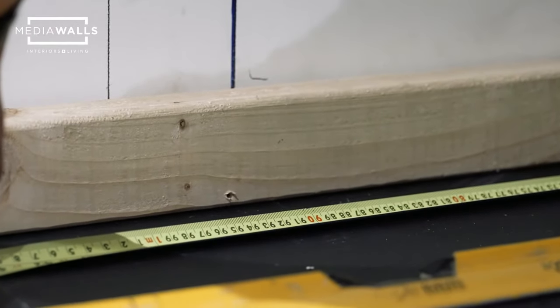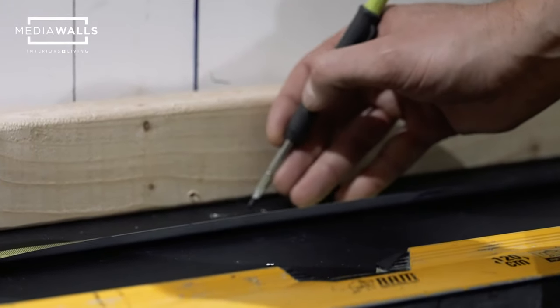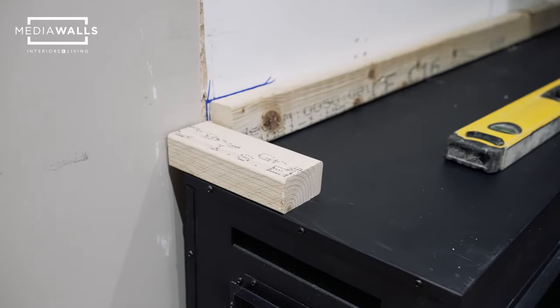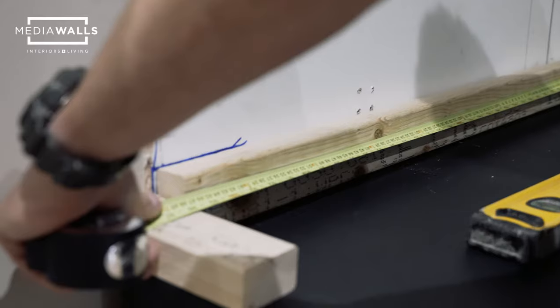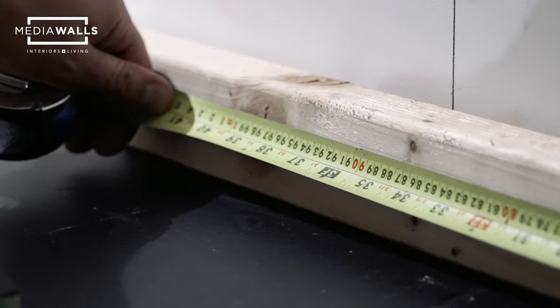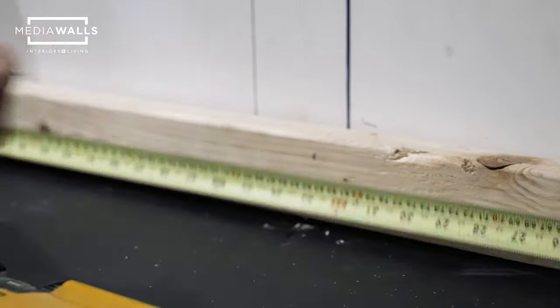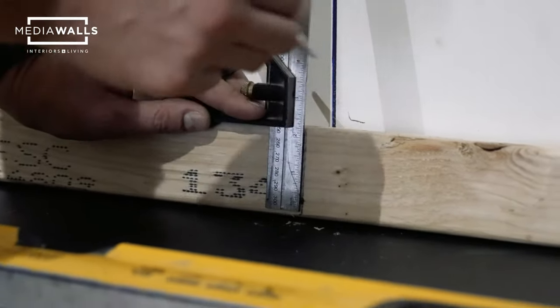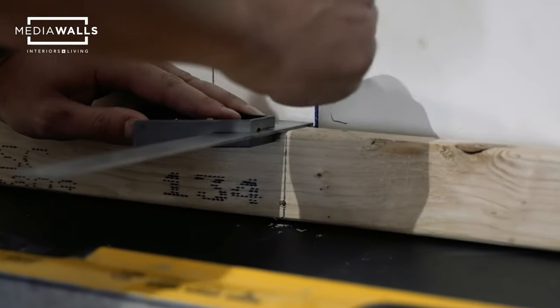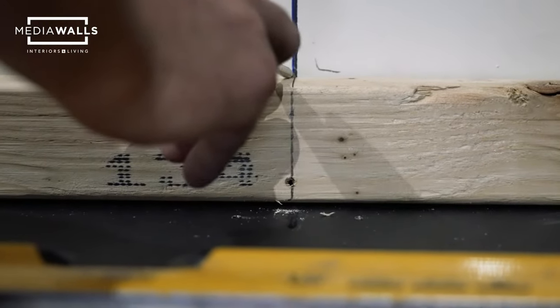Because this fire is the 1800 model, the halfway point is 900mm, so I'm just going to draw a mark at 900 along the top of the fire in pencil. We've laid two offcuts of timber at either end to give us the distance for our back piece of wood. We measure the distance of the wood and find the centre point, then use an adjustable set square to draw the centre line square to the piece of wood. This allows us to get the piece of wood exactly in the centre of the fire, matching the centre line on the wall.